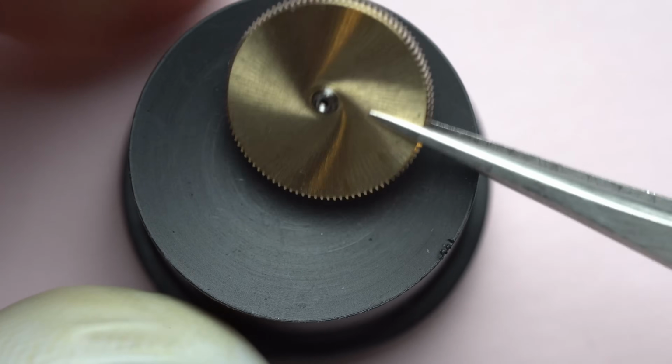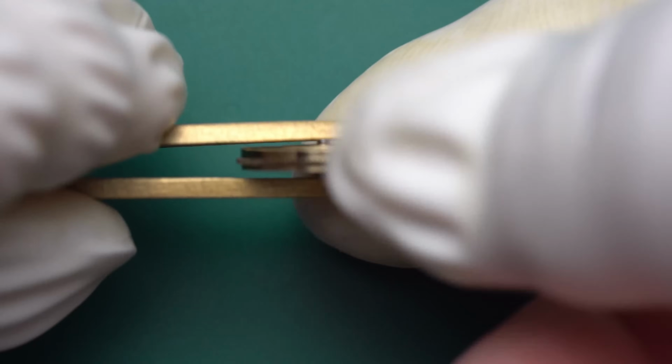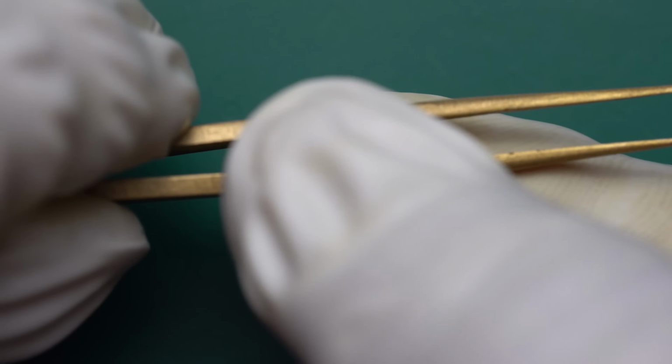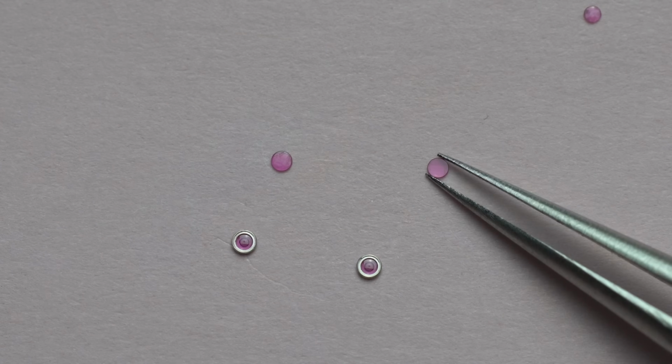And there we go. So now we have a fresh barrel. This one's perfect. It's in perfect working order. So now what I like to do is check my barrel end shake. There's going to be some tolerance. You need tolerance for something like this. Once again, this is a moving part. So if there is no end shake within the arbor, it just won't deliver power correctly.